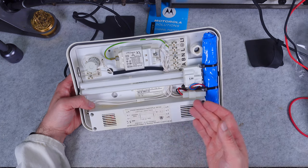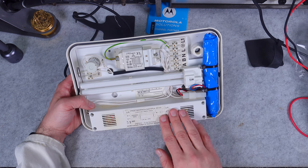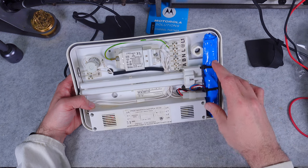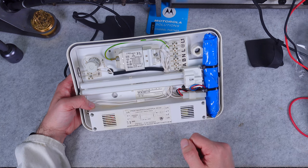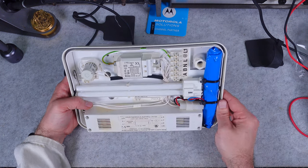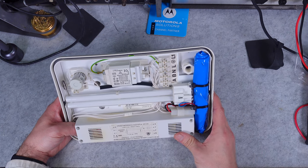On the bottom part we've got an electronic ballast with an integrated charger. When AC is present, this device will charge our battery. When AC is not present on the emergency line, it's going to invert our battery into high voltage and run that tube. Now I'm going to present how to wire up that enclosure.